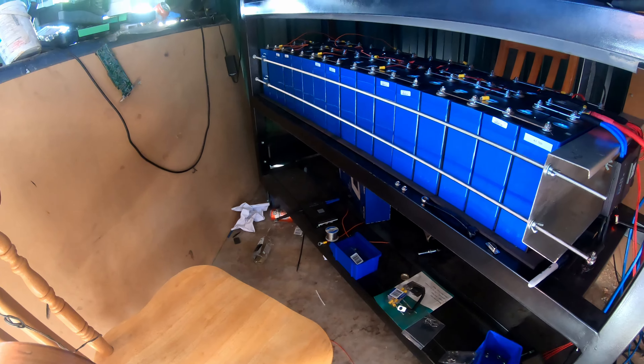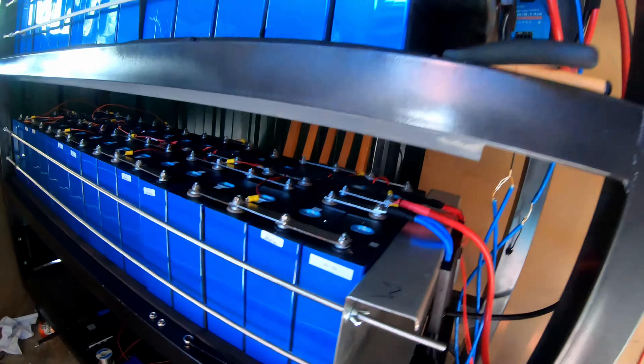As you can see, it took way longer than we thought and quite a few more beers than expected. I was wrapping the balance cabling in Tessa tape, but all it's doing is obscuring where the wiring is — it looks nice but it just obscures any troubleshooting. So I've decided to leave some parts exposed so I've got an area where I can start cutting. I did it here because I wasn't confident the shrink wrap was protecting it well enough, and on the top I fully covered it — I don't think that was the best idea. It's not the neatest wiring in the world, but it's a lot of wires, and if you've got to troubleshoot it you want to be able to intercept the wire somewhere and see if you've had a short or a break. So I've semi-wrapped this particular shelf — I feel like that'll do for the time being.